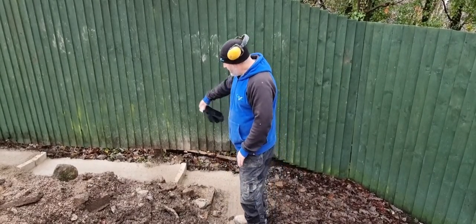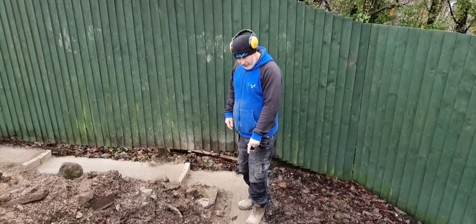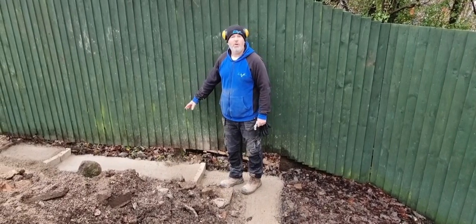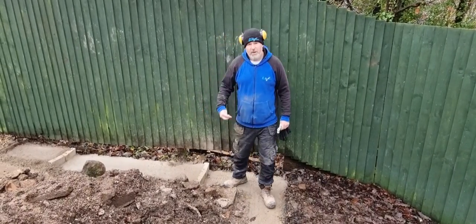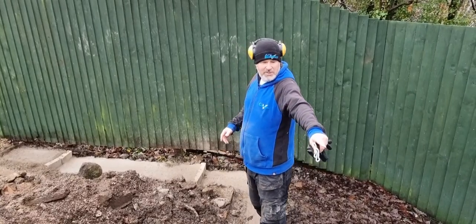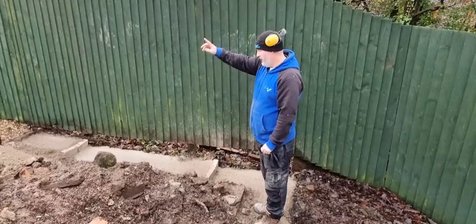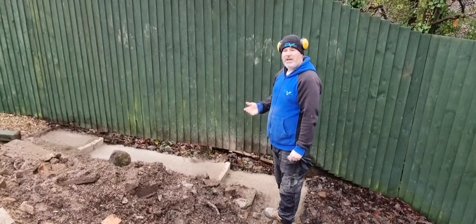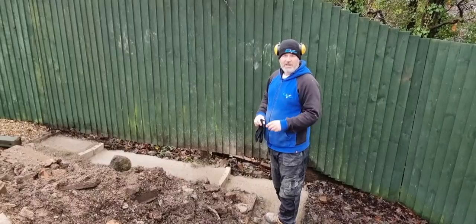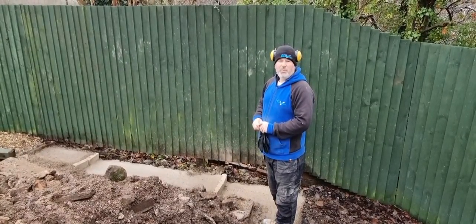We put these footings in yesterday. Couldn't show you because it's pouring out again. So 150 mil deep, these foundations are. 100 mil steps, going to have block on flat up here, so we're retaining with weed poles, and then we're going to build this section up, and the same principle of what I just explained in there, all this then will be gone. We're going to get rid of all this, and we're going to raise our levels up with scalping ready for the artificial grass. So there we are, there's the explanation for you. We'll whack you onto hyperspace and you can watch us do it.